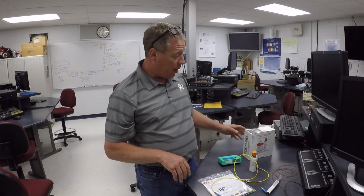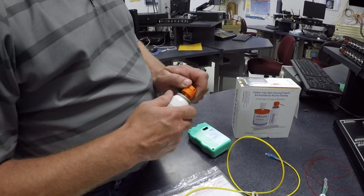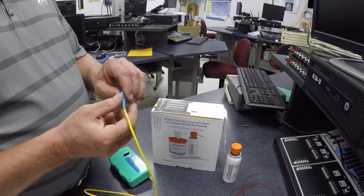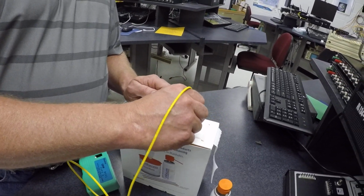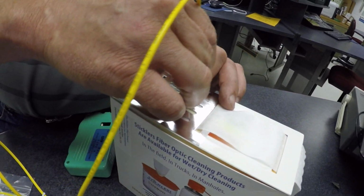Today in this video we're going to demonstrate fiber test equipment and cleaning equipment. That's important. The first item I'm going to talk about is cleaning connectors. We have a couple different types of cleaning devices. This is an alcohol spray, which is a wet type of cleaning. We spray that on here, and it's alcohol based. You always clean, test, and clean. So we get that wet, and then in these we just go up and twist as you go down each one of those to make sure it's cleaned properly.